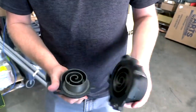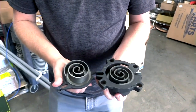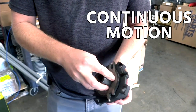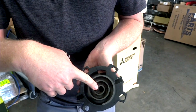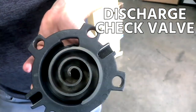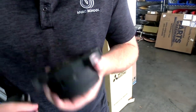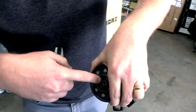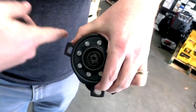The one thing I wanted to show you here is that there are no traditional valves — no typical valves that open and close in different strokes. It's just a continuous motion as it oscillates. But what it does have is a discharge check valve. Inside here there's a discharge check valve, and if we listen really carefully you might be able to hear it. That discharge check valve opening and closing underneath here prevents refrigerant on the off cycle from rushing back through the compressor.